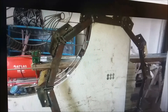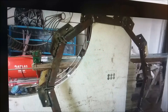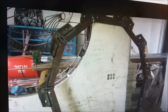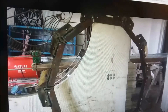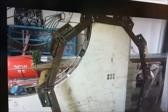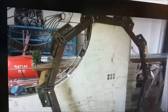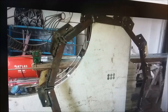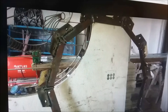There's a temporary floor on the first floor ceiling covering the atrium, because we're using it as a workshop — it's a 26-foot-diameter room. It also served as part of the formwork: it held up the spider beam when we poured it. We took the upper layer of shoring off and we're going to use those supports on the cistern, then on the dirty kitchen, then take them apart — there's nothing else that's going to be poured that's 11 feet tall.